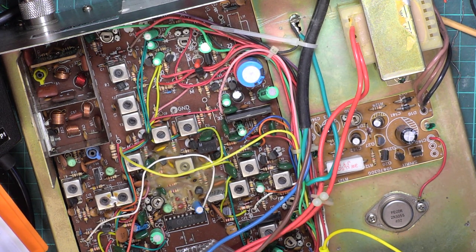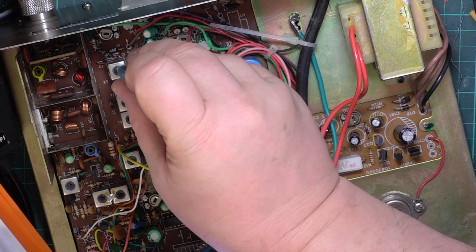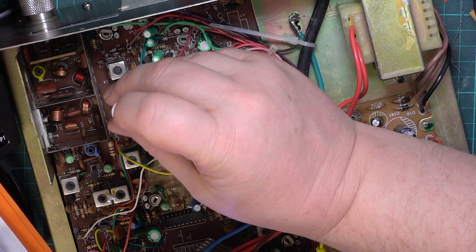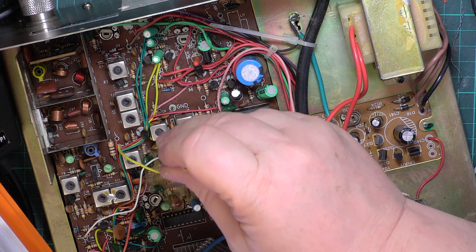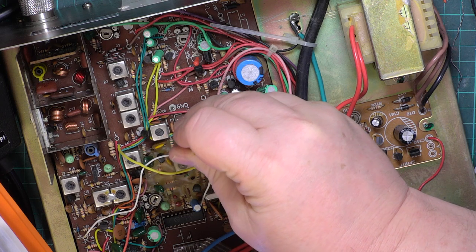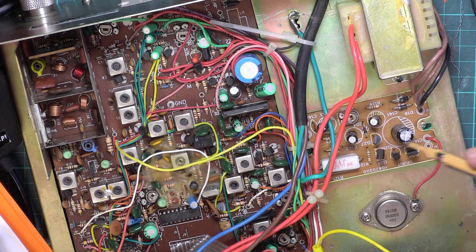So back to 0.3 of a microvolt and the camera onto our SINAD meter. So we need to set that so we've got about 4 decibels. It's there. That's working very well indeed. I'll just turn the volume down a fraction. So we'll start with T1. T2. T3. Funny, you know, how many times the transmitter's screwed up, but the receivers are pretty spot on.